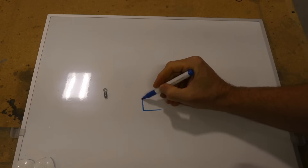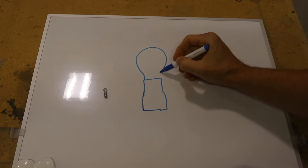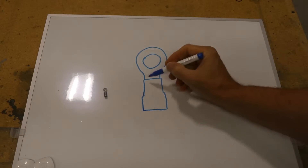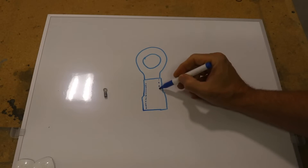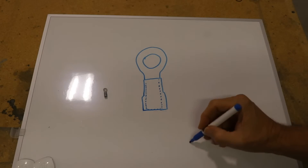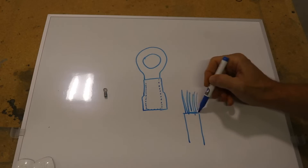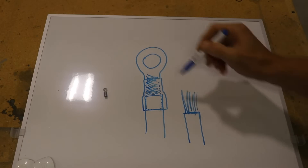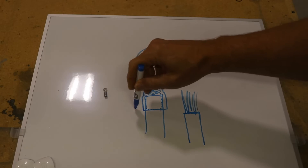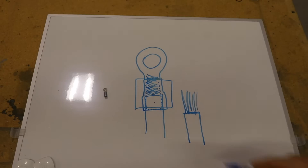Let's take a typical aviation terminal. The outside is plastic and the inside is metal, and that metal comes all the way back to pretty much the very end. When you insert your wire — the outer jacket part goes up to a certain point, and the stranded part of the wire goes into the metal crimp section. The crimper crimps this entire area, both on the jacket and on the braided wire part. That's exactly what you want for a good secure joint.